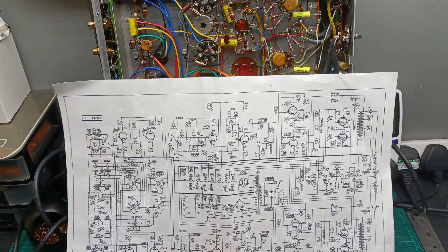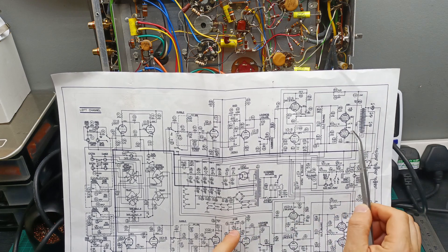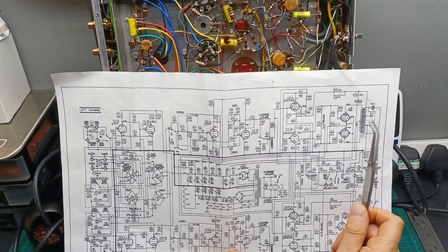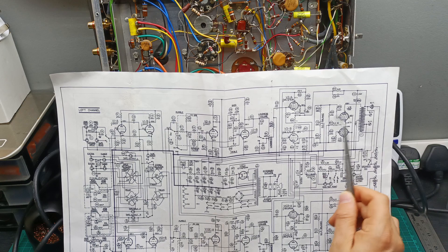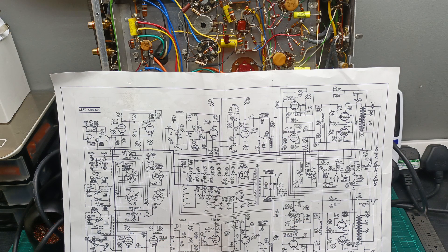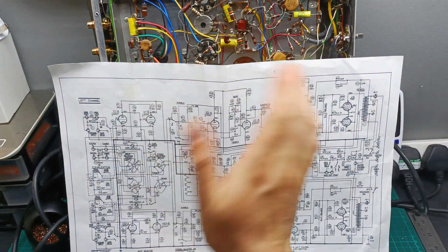Now I still need to do all the connections — from here to the transformer, and from here to the tubes. But I may do it a little differently, because as I said, I'm going to try to use the existing output transformer which is different, and then do some modification with this voltage — maybe getting it from the output transformer instead. Then I'll need to do all the connections to the other tubes. Stay tuned, please subscribe and activate the notification bell, because we're going to see all of that in episode 2 of this HH Scott audio amplifier series. If you enjoyed this video, don't forget to give it a like. Bye bye for now and have a good day!